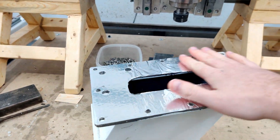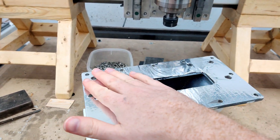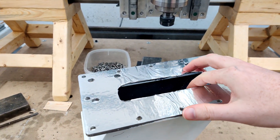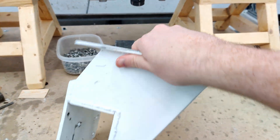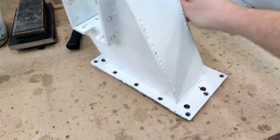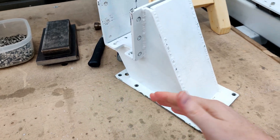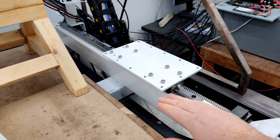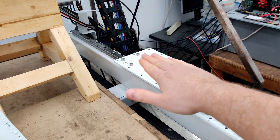So I'll use my flattish stones to flatten this all down so it's quite flat, and then when I bolt the bolts on the front, back, and sides, everything's going to mesh really well with this face — this plate that's been machined.